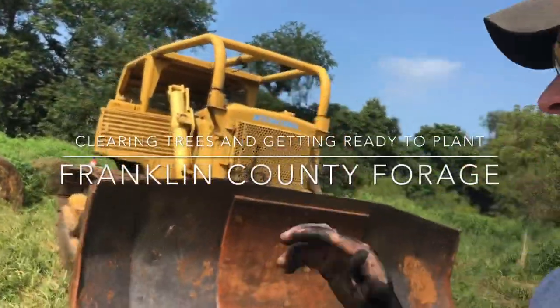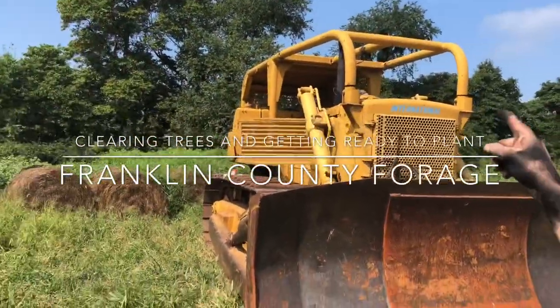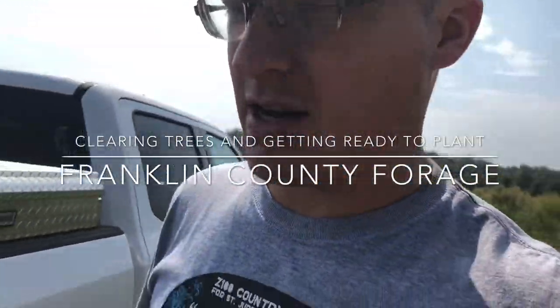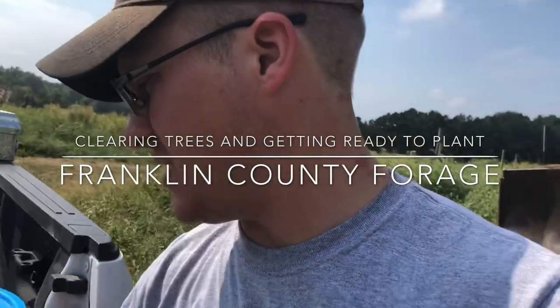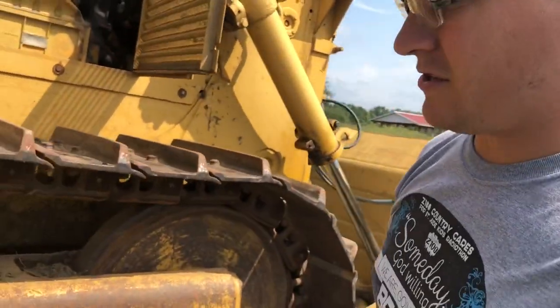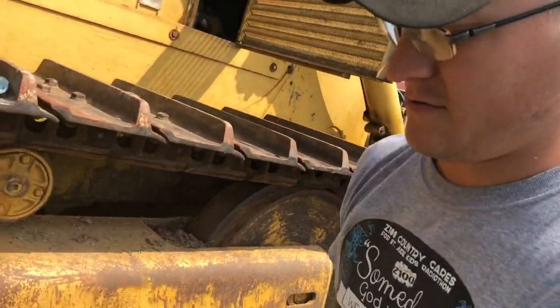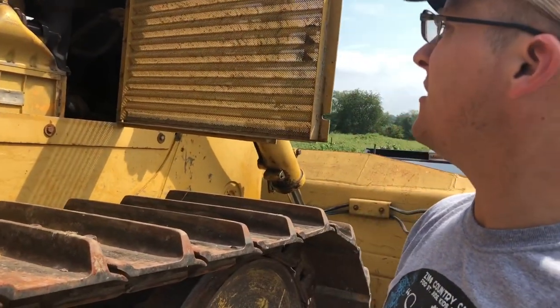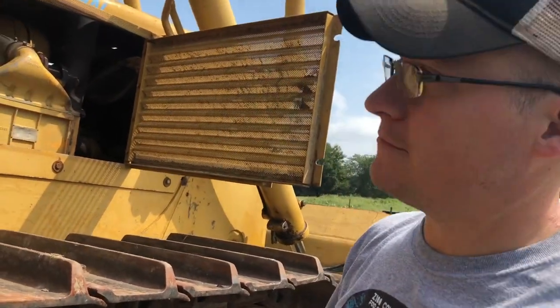Got the turbo unstuck. Dad's up working on the switch right now. I am going to grab a bucket of hydraulic oil and put it in the tank. I know it's a little low. Stuck a socket on that turbo impeller and it spun pretty easy, really. But once I got it loose, then I can spin it by hand, so I'm sure it'll spin now. Shouldn't smoke near as bad.